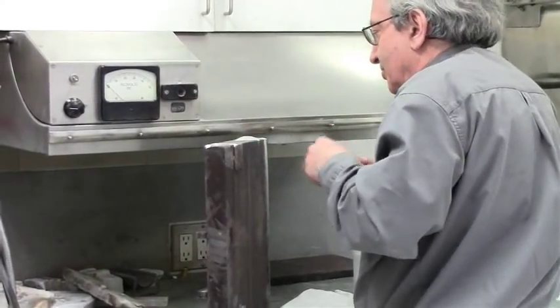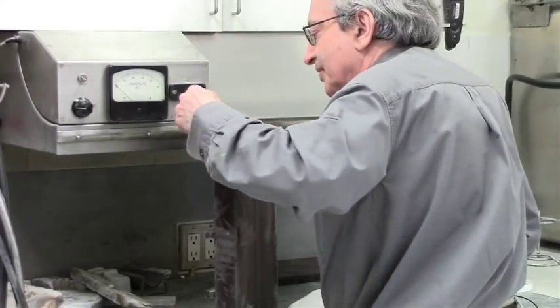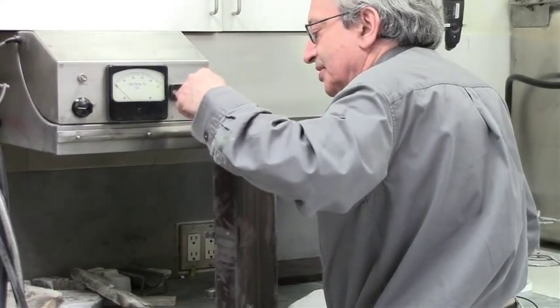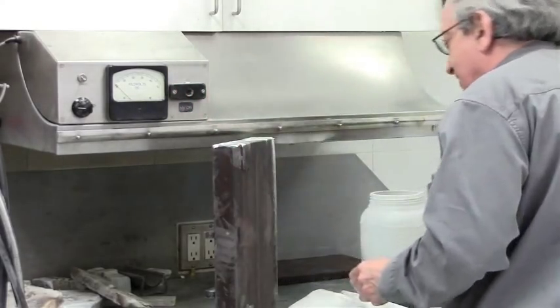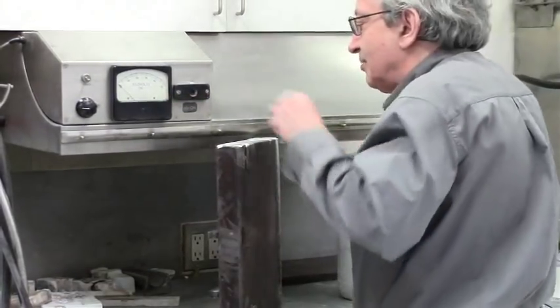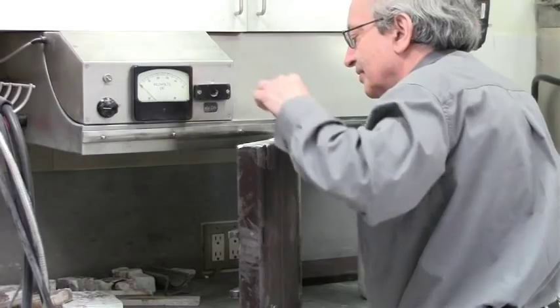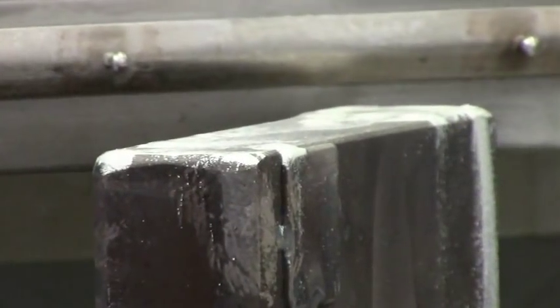Okay, so the powder melts, and just beautifully becomes solid epoxy, or whatever it is, polyester, and fills all the dents. Okay, it's already melted. The powder not only melts, but cures. Within a minute, it will become rigid. Check if it's all filled. Yeah. And when we finish, we can just sand it flat.